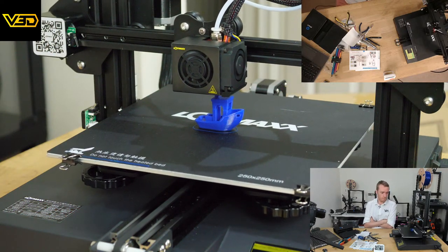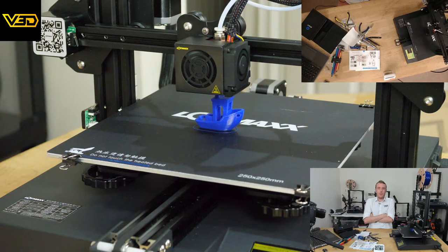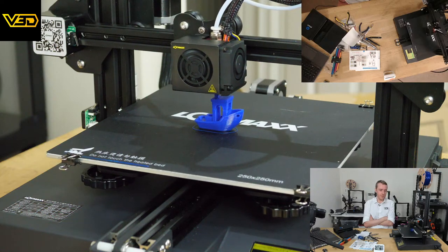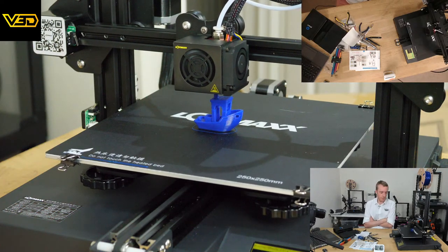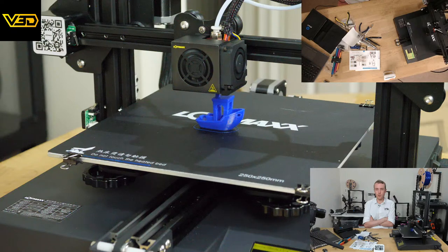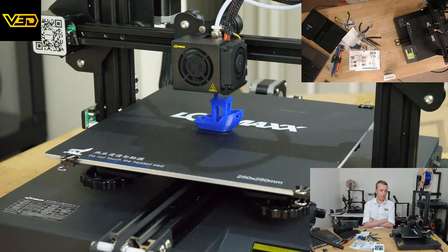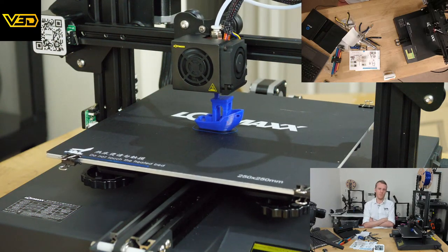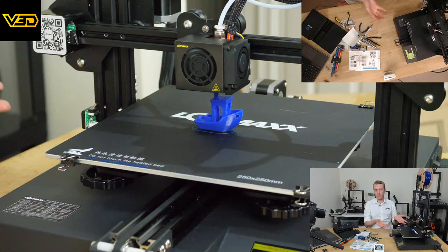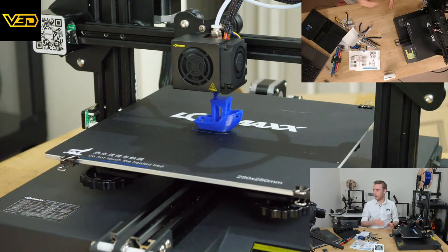So my models for doing the testing that I want to look at, I'm not going to reveal them all now. I've got a few lined up that I think are really good. One technique that I found for doing some calibration is super promising and absolutely epic. But at the moment, I'm not revealing too much, but they're quite simple. It's not just a cube and stuff like that. It's a little bit more complex than that. There's quite a lot of thought that goes into why certain shapes are the way they are. But it allows you to do either calibration or testing. You can't really do both at the same time. If you're calibrating, you're adjusting geometry, adjusting variables in the printer, etc., to determine an outcome. Whereas testing is leaving those variables alone and identifying what the performance of those variables is.